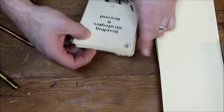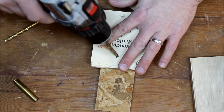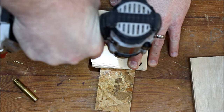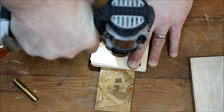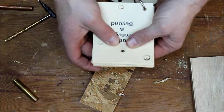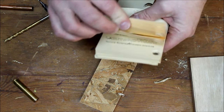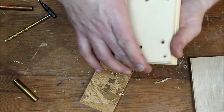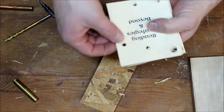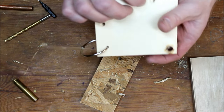The hole was too big — I wasn't trying to go for a smaller hole. I found when you try to drill into this with a regular drill bit, I'll show you what happens. I held them down tight, let's just pretend these are all aligned, held them down tight, and started to drill through there. What happens when you do that is you get a pretty clean hole. But again, it deforms the paper and it rises up on the drill bit as you do that. The exit hole is okay, it's not too bad, as long as you have a backer board. So I was closer with the drill bit, but it was getting a lot of tear out depending on the drill bit I chose. That's what you're seeing here — me trying to do it repeatedly with different drill bits and finding that it was really tearing out on me.